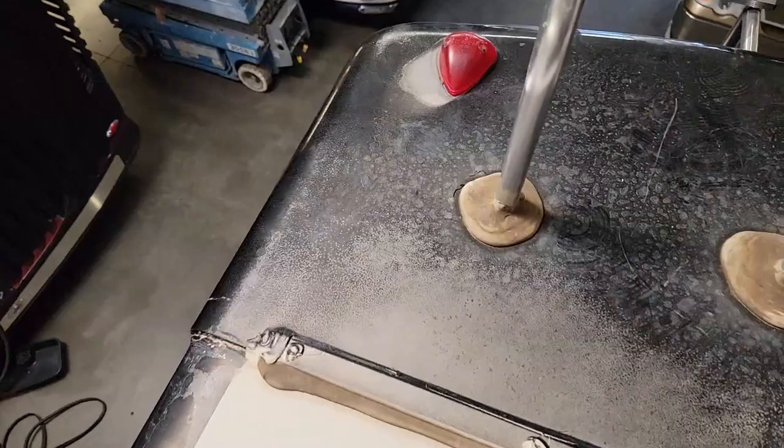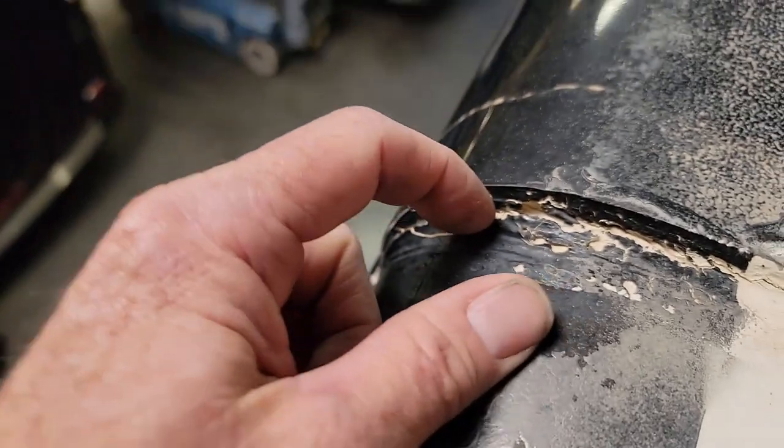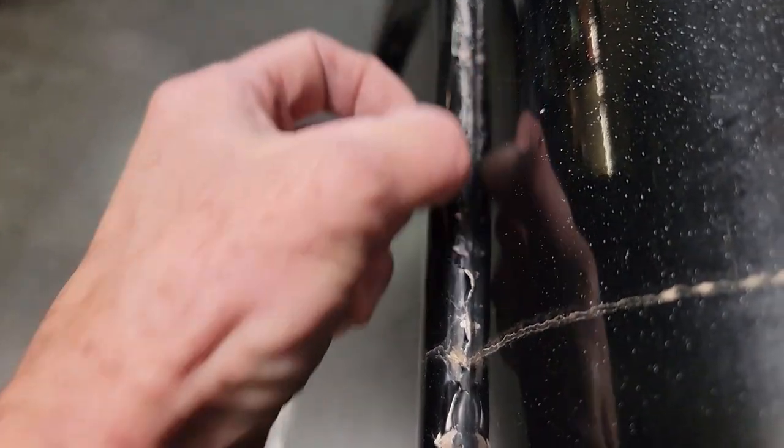Dicor will not stick to this roof sealant. So if it's a silicone roof sealant, Dicor is not going to do any good — you need to make sure you're using Nuflex 311 or self-leveling silicone. I do like that sealant; it seems to last forever. This gap right here — maybe I could recommend we touch it up. It only really looks bad because it's a flexible sealant and the paint that was painted on there will start to chip off.